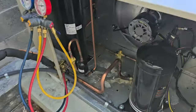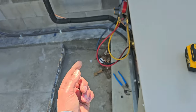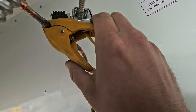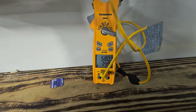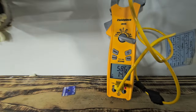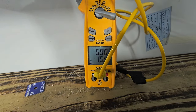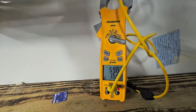We're going to adjust the room thermostat — here it is, and we are going to go below the room temperature. You can hear it click whenever we set it below the room temperature. That's when it closes, and when it closes the liquid line solenoid valve opens. When the room temperature goes below our set point and the thermostat opens, the liquid line solenoid valve will close and that will pump down the condenser — it'll go below the cut-out and shut down. Applying power to the room thermostat, liquid line solenoid, and the fans. Fans are running. The condensing unit is running. Now I'm going to go back inside and measure the temperature difference across that liquid line solenoid valve — one side of the valve to the other. It reads 58 degrees.